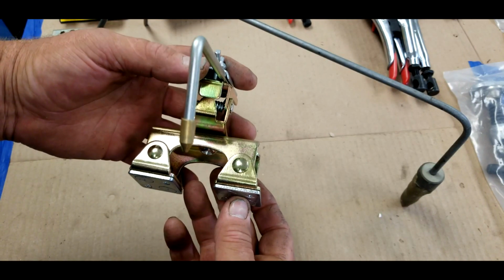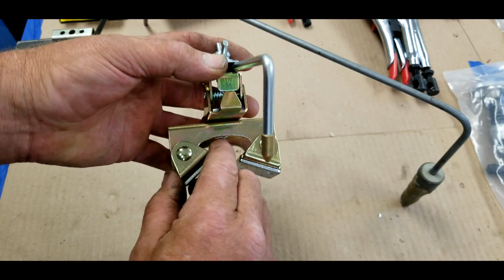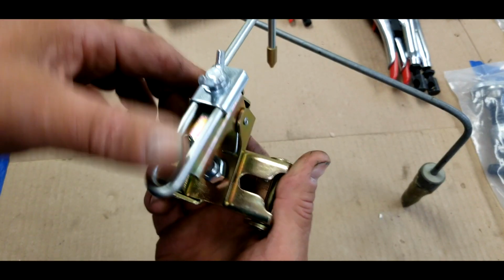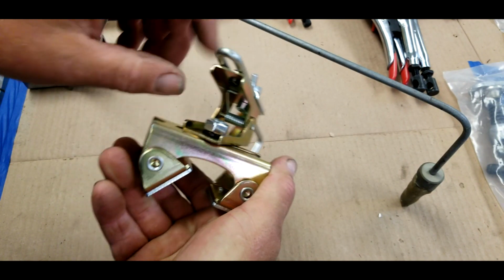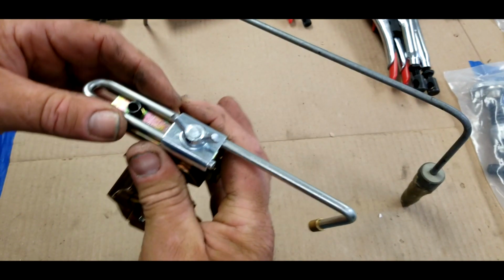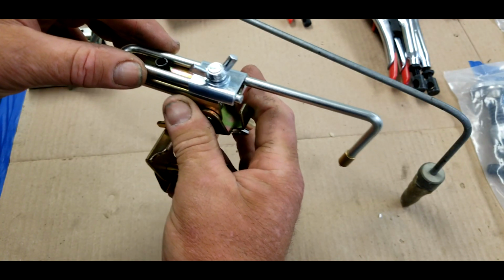They call it a Grasshopper. It's got a magnetic base with swivel pads. Kind of cool. And then it's got a spring-loaded clip here. And this actually swivels. And it's got a tension screw there, looks like a tension washer underneath. So it's got a nice feel to it. And then you can adjust the finger in and out as required.